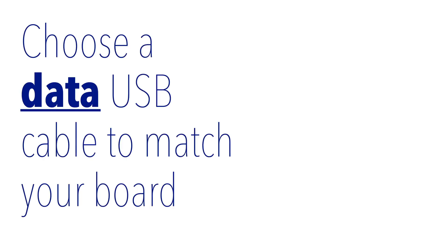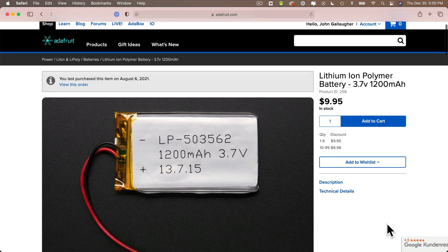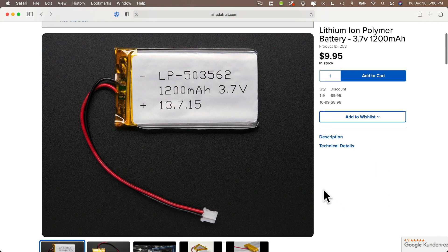Now that also means that you'll need a USB cable to match your board. Pay attention when buying your board — some boards use micro-USB while others use USB-C. Make sure that you have a data cable, not a charge-only cable, since you'll need to initially send your program from your computer to your board. You can charge your battery by plugging your USB into your PC, or use a standard cell phone wall jack. I chose a 1200mAh LiPo battery.